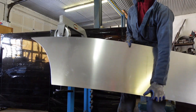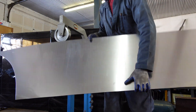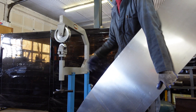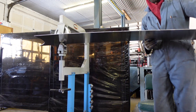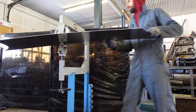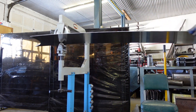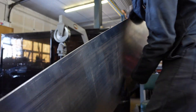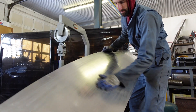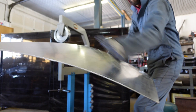I ended up doing it in 1/8 thickness — gives a little more rigidity. I'm going to roll this a little bit in the English wheel, just to give it a little bit of crown because right now it's a little floppy. Just using a real mild die — you can't put too much tension on these because aluminum likes to mark. You want to go real slow, otherwise you make lines in it. I really want to get more of a curve on this end, more of a crown there.